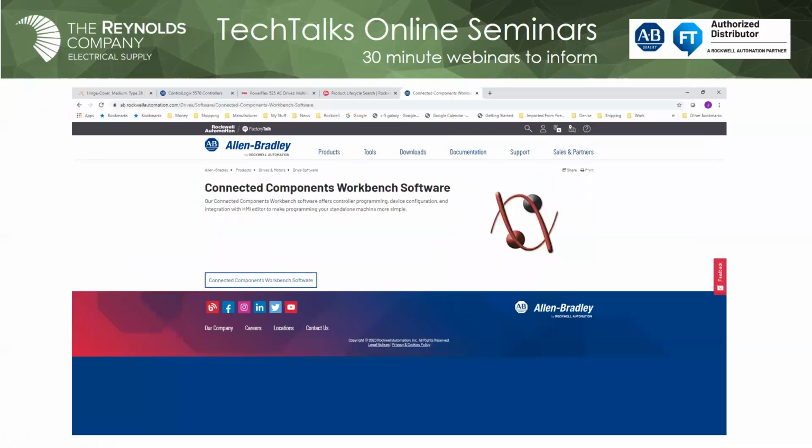Okay, Mark? So this is the final part of the presentation today, drive software. Back on the previous tech talks, we talked about if you have a 160, you might have used Drive Explorer. If you had the 1305 or 1336 drives, you might use Drive Executive, Drive Tools. And those would even do the PowerFlex drive. You may have to download the drive profile, but you could do it.